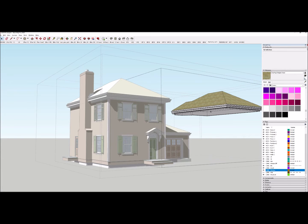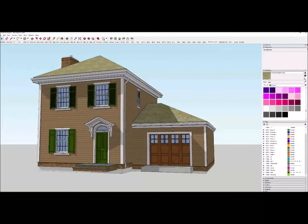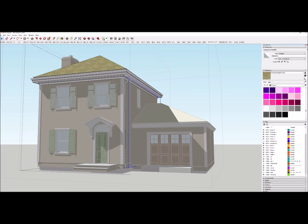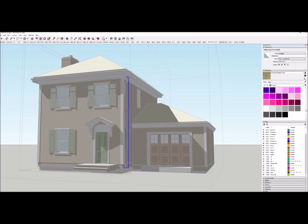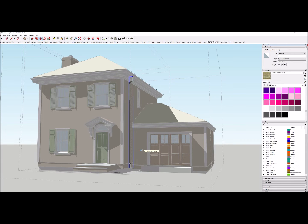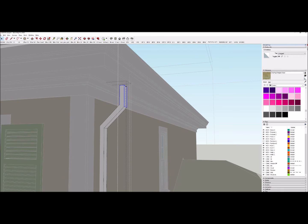And there's a downspout to the right of the front door around the corner. I've got to make some adjustments to that downspout because now with this new cornice, it overhangs a little bit more, and the downspout needs to intersect into the bottom of the gutter itself. So that's what I'm doing here. I also did the same to the downspout in the back. I didn't show you that because I didn't think you needed to see this all twice, but you'll see the finished result when we get around back.